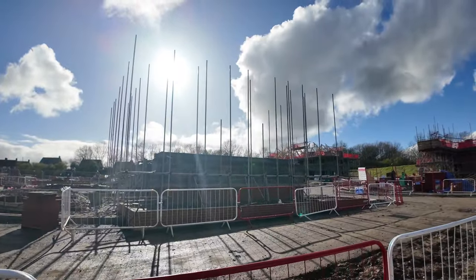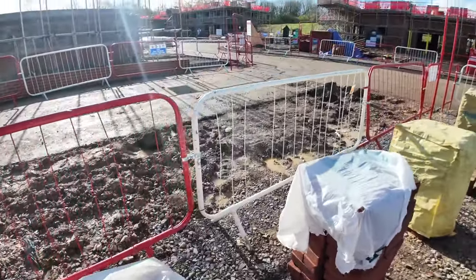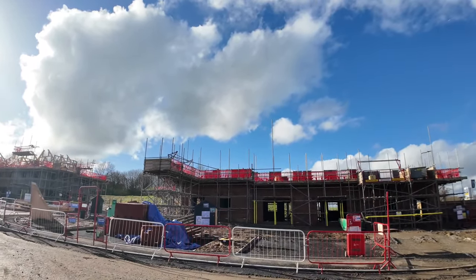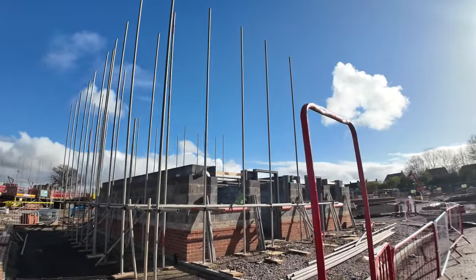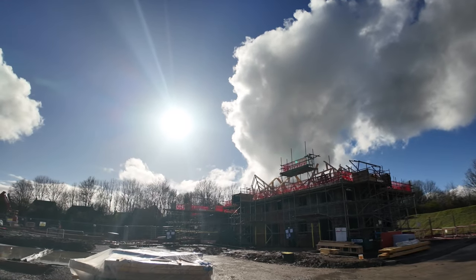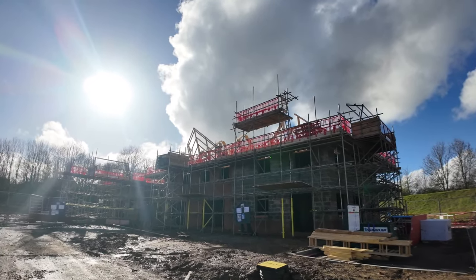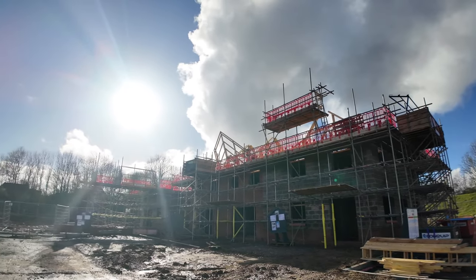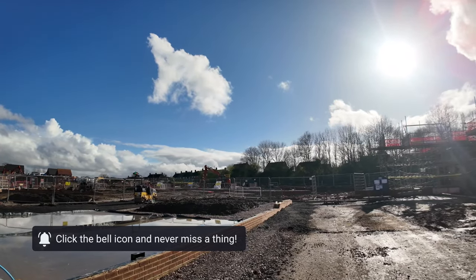Then we come across to the rest of the site. This is what we're doing at the moment with our bricks — we're having to cover them just over the top to let the wind get in the sides to let the air get to them. There's another block of five over here. The two end plots are actually maisonettes — ground floor as an apartment, top floor as an apartment. This is a cladded plot as opposed to render, much better — I think the cladding looks lovely. There's another block of four and a little detached one on the end. The site's starting to open up now. You can see our scaffold fans in position — we do this across the board now. On the second lift the scaffold goes up, the fan goes in, we open up the doorway so you can get in and clean the plot out. There's a skip bay and loading bay on every plot. And then the groundworkers are cracking on, working across the field.